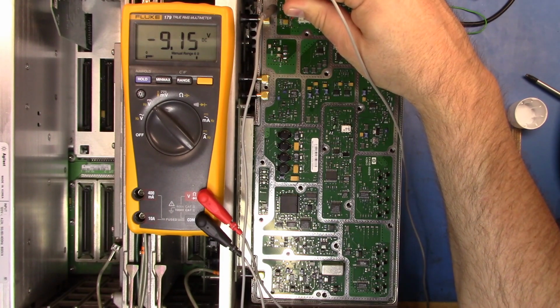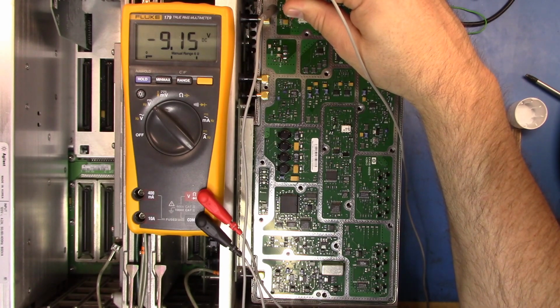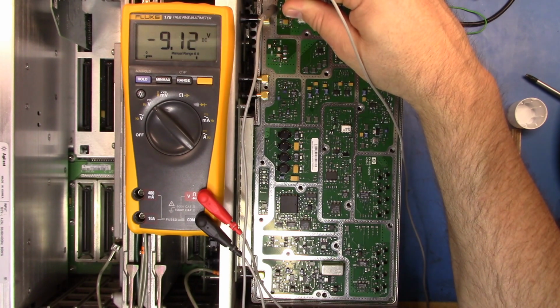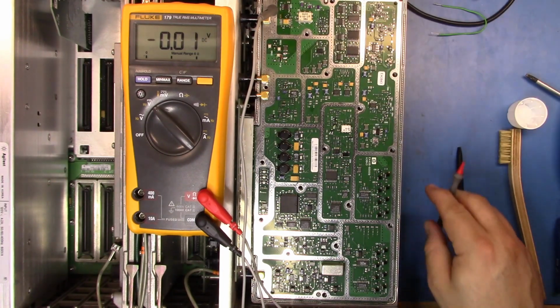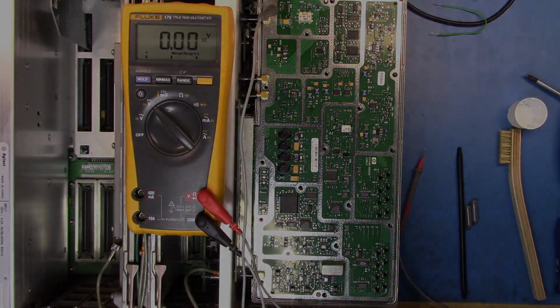All right. Okay. Yep, so we're getting control voltages. They're not sagging. This thing should only draw 100 microamps, so it should be more than capable of being driven by U26, which is just here. So, you know, there is clearly something else going on.